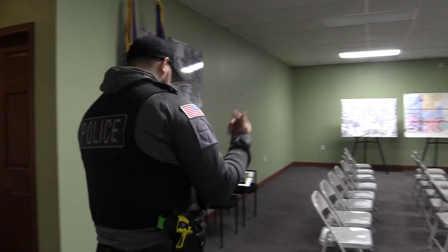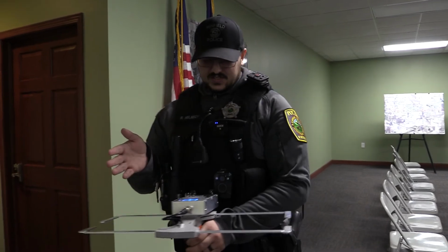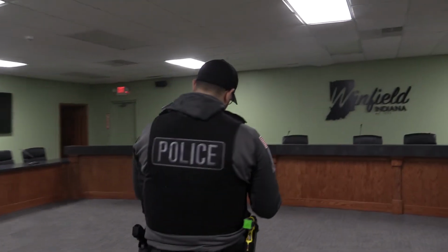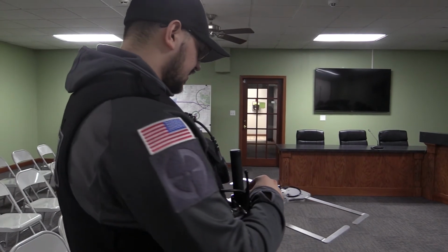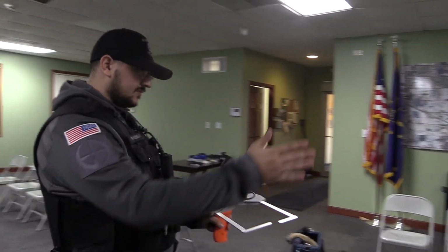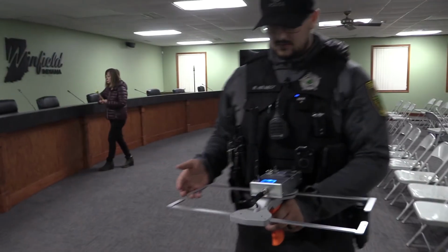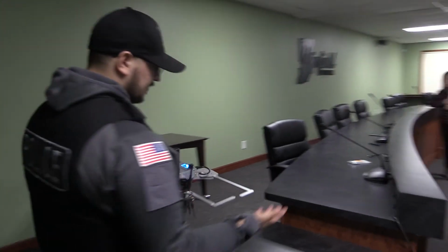So what I'll do is I'll do a 360, nice and slow. Okay, it's quieter over here, so I wouldn't go this way. But as I keep turning, it's going to get louder. It's loudest this way. So I'll walk a little bit this way. And then I'll turn it down to the lowest range. And this would be if you're right on top of it. So we know it's in this area somewhere. As we turn back, we'll follow the chirps as you continue to go forward. And then as you can see, we're right on top of it, and that's the loudest it's going to be.